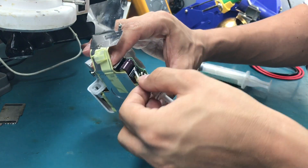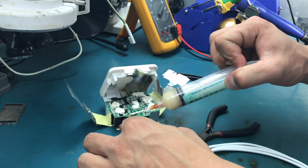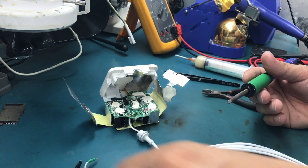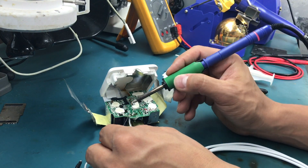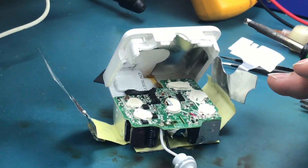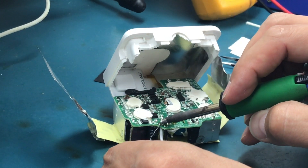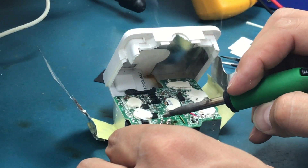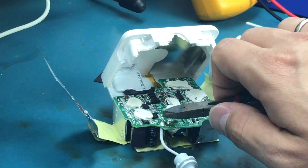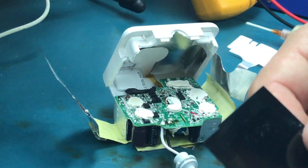Let's do the white one. I'm feeding it into the hole, adding a tiny bit of flux, then the solder wire. I'll zoom in a bit. I'm feeding the wire and melting both surfaces at the same time — the board and the cable both have to be hot simultaneously for a proper joint. Once it's fully cooled we cut the extra, and now we can put the protective plastic back on.